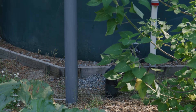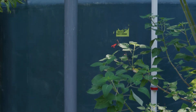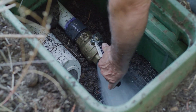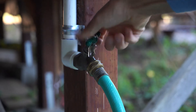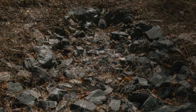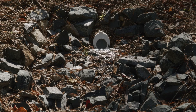Inspect the conveyance piping systems, both wet and dry, annually. If freezing is predicted, drain the wet pipe system using the drain valve. Check the hose bib for leaks annually and replace the washer or other parts as needed. Inspect the overflow rock riprap pad annually, and check that water is flowing when the tanks are full and there is no erosion or clogging.